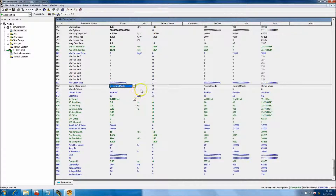So we throw it in demo mode, and now the servo controller knows it's going to run on a derated voltage. It changes all the parameters it needs to change to give you a valid bus status. For instance, if you wanted to program something and run it off 110V but your system wasn't rated for 110V, putting it in demo mode gives you the ability not only to run it but to have the bus status bits work properly. Without demo mode, it would just report that you don't have enough voltage.